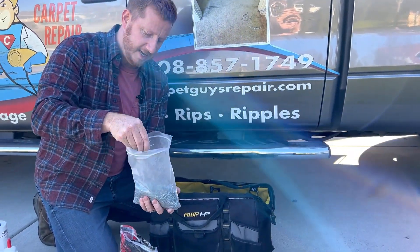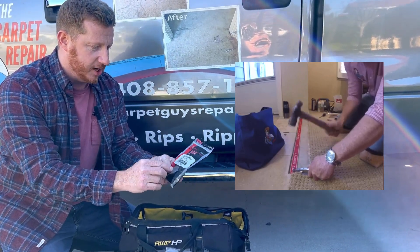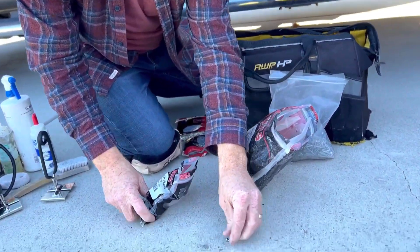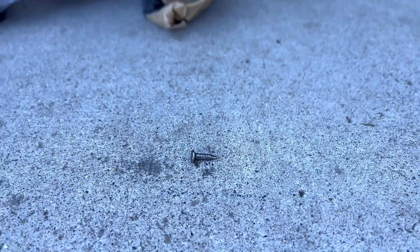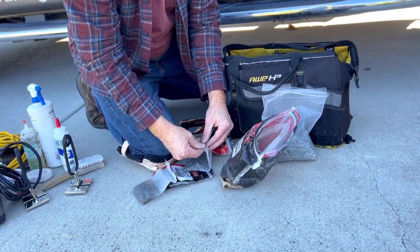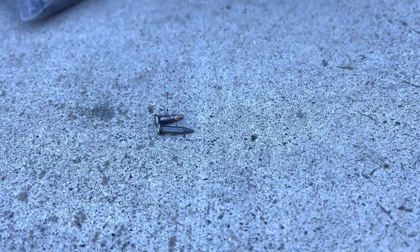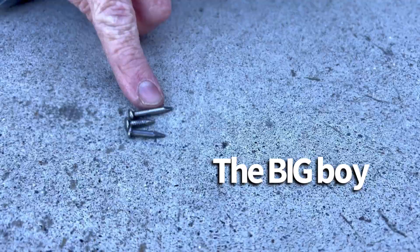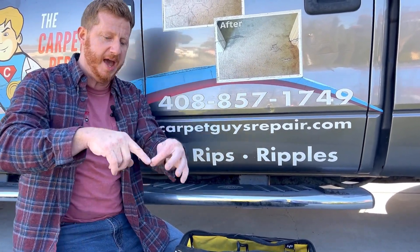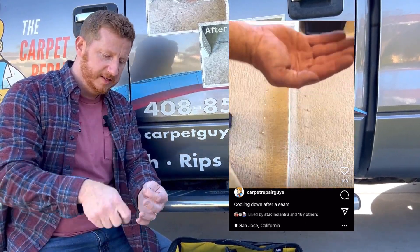I've got my backup nails — inch, inch-and-a-quarter, sometimes inch-and-a-half. We can nail into concrete. The most common is the 10-gauge 5/8-inch concrete nail — it bites into concrete through the tack strip and holds the tack strip in place. Sometimes you're going through metal and other layers, so you'll want a 3/4-inch nail. If the concrete's all busted up and cracked or has multiple layers — VCT tile or linoleum over it — you've got the big boy, the one-incher. I'll use these as stay-tack nails that go through the carpet, the pad, and bite into the concrete when I'm stretching, then pop them out after the carpet is seamed and cooled.